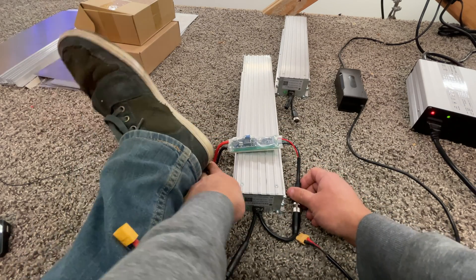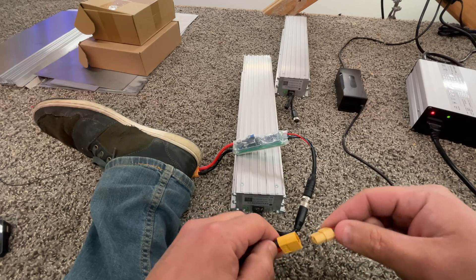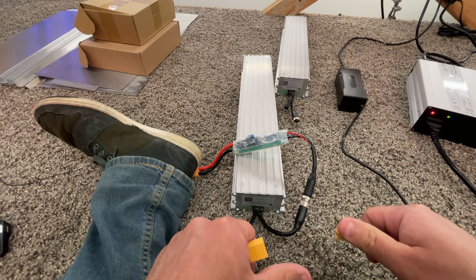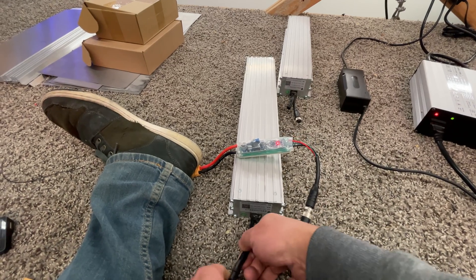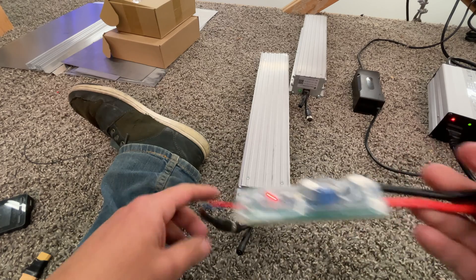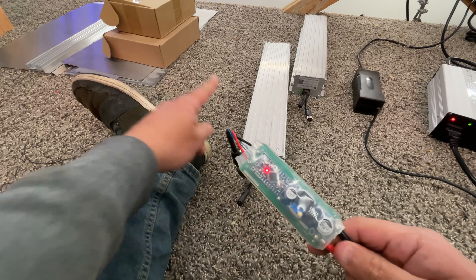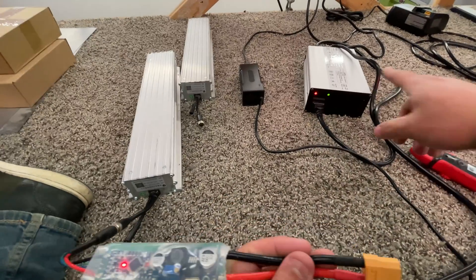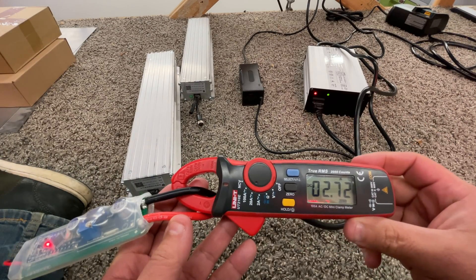I'm going to put the dongle here so we can see the light come up. This is the small charger, and we're going to apply voltage momentarily. You see that? The light turned on — the light came back on now and it's staying on. Now we can disconnect this. Boom — there we go, your batteries are on. Once they're on like this, they will stay on. You can put a load in here, and the dongle is sending commands to the battery to stay on and work. You could also now use the big 18-amp charger to charge this. Now that it sees the voltage — 2.72 amps — so it is charging.